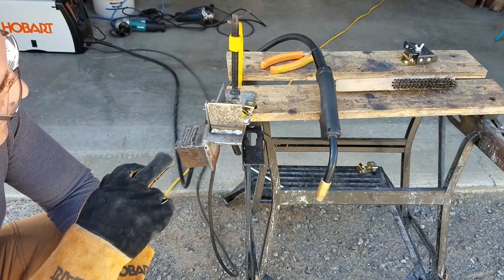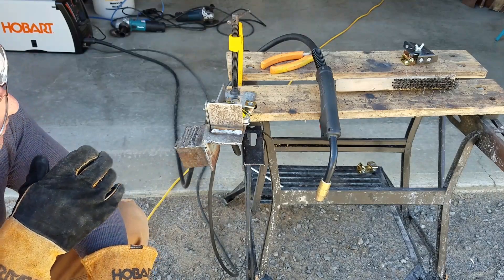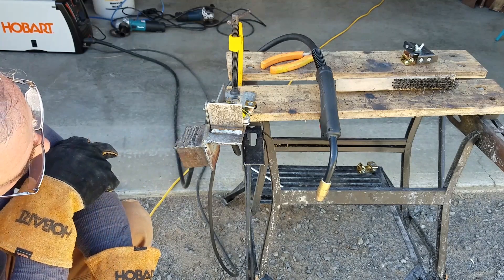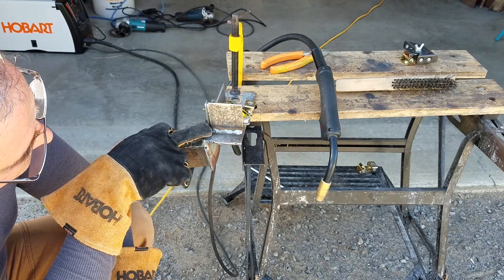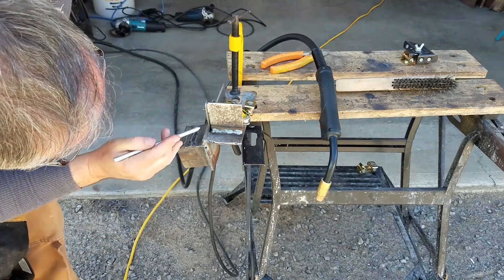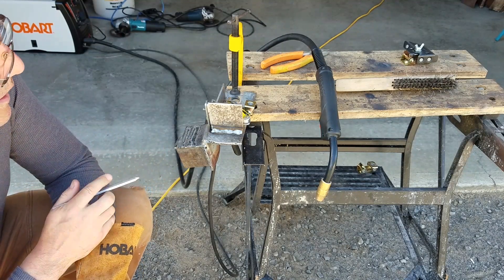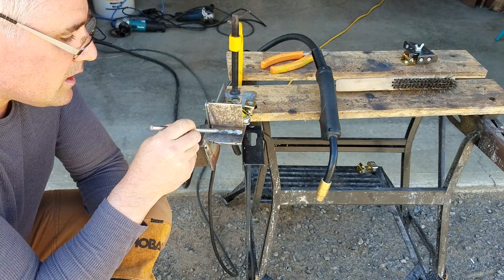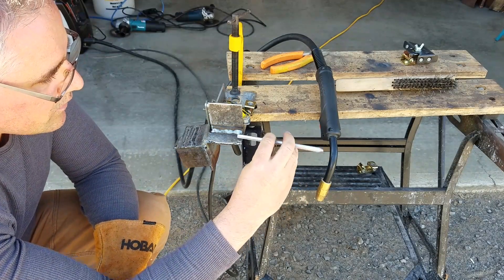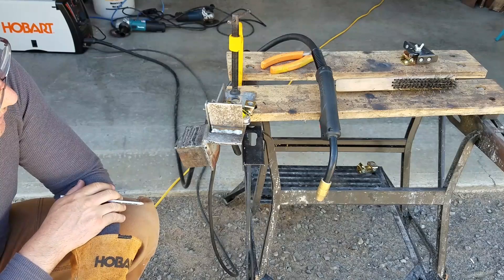Alright, let's take a look at this. This is a clean weld. There's some spatter at the beginning here, only because I didn't get my movement in yet. But you can see, this is a very clean weld. There's a little bit of coloration in the metal above — I'll point it out with a pencil here. From here up there's some discoloration, a little bit of discoloration coming out of that metal. But as far as spatter goes, there's a little bit at the beginning here — this is where I started my weld and I wasn't sure what my speed was going to be. But that is a nice looking bead.